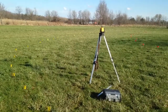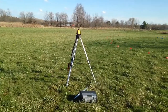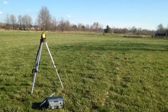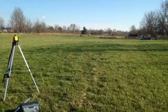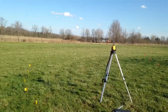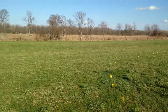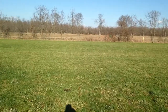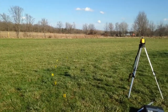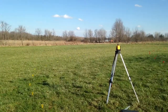We've got the laser set up at an arbitrary point. The yellow flags indicate the contour line from the key point. The red flags are the contour line one foot in elevation above that, and the blue flags are at a point two feet above the contour line run from the key point. We're going to lay out one, possibly two contour lines to the northeast, and maybe make some adjustments in a key line-style method.